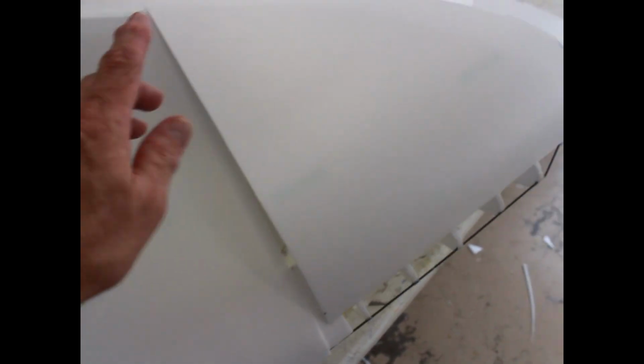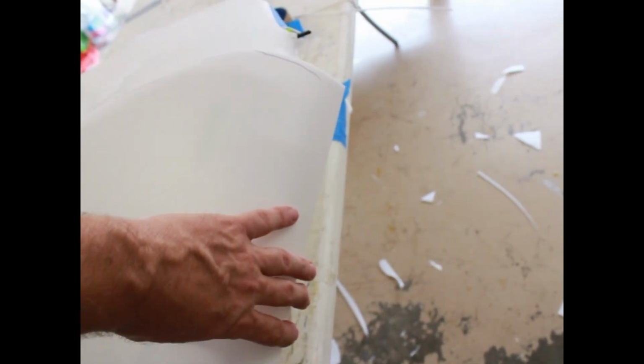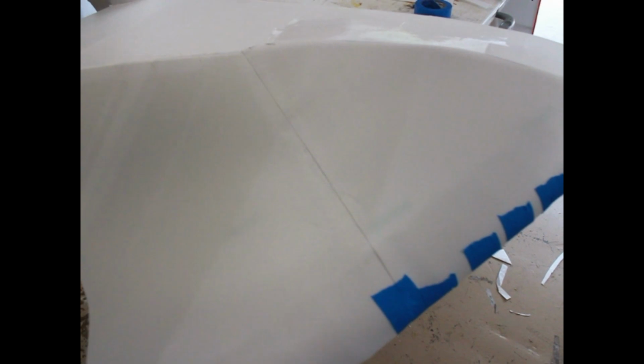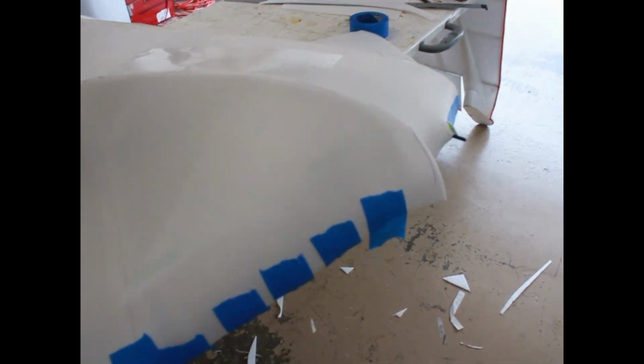Edge fitted, I just kept making little cuts and lines until I put a little starting mark right down there, and when that goes all the way up, that seam just matches perfectly. So I work with that for a few minutes, and then I cut this a little bit big there, and when this wraps down here, I cut that a little big there, and I pre-curved it, glued it on here, and then I just wrapped that over just to hold it up against the ribs.